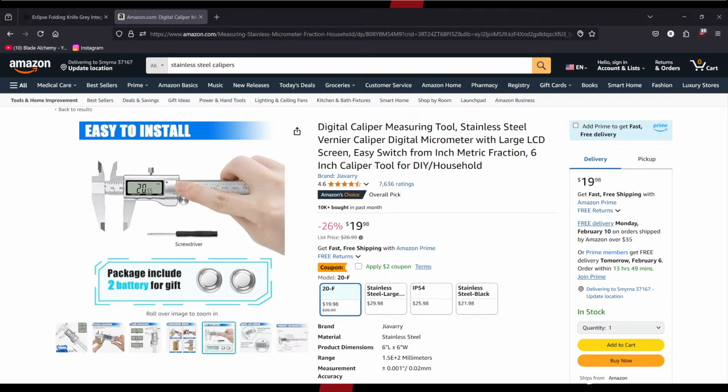Well, okay. So there's only a couple of measurements that you need on a pivot. Let me take apart this Kaiser really quick and show you how I would measure it. And I don't know, somebody else can chime in if they got a better way. But usually they're going to give you two measurements. They're going to give you the overall width of the pivot or diameter of the pivot, and then they're going to give you a length of the pivot.